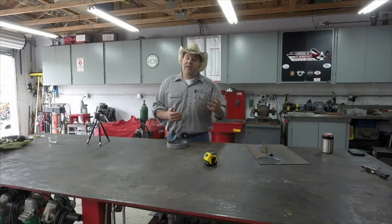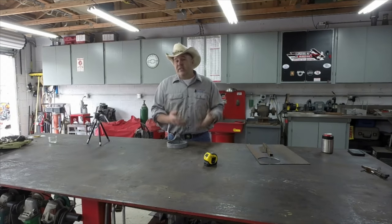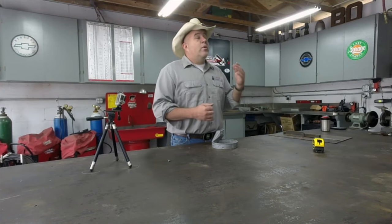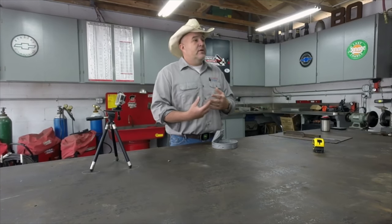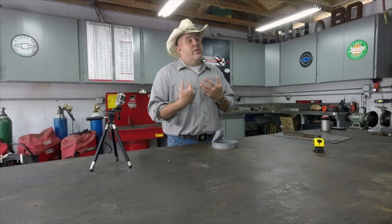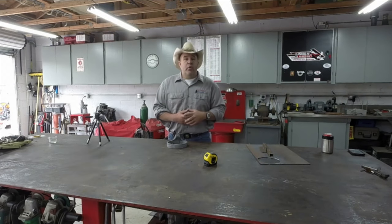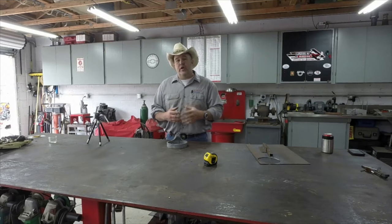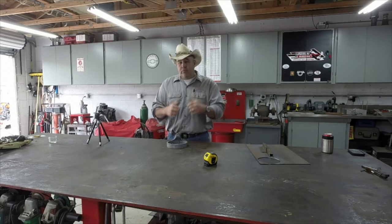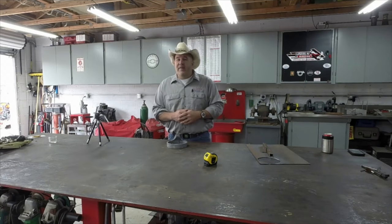The way I've always treated it, and the way many other welders that I know treated it, is if you weld it and you know it was clean and it's got junk in it, just grind it out and re-weld it. By grinding it out, we mechanically are removing those impurities, and hopefully we're back to good metal because we've liquefied it, we've allowed it to float out. Now we'll come back and weld it again. I have had to do it as many as four times because of really, really bad junky cast metal. It needed to be welded, and about the fourth time I did it, it was jam up. Most of the time, you really only have to do it once, but every now and then that does happen.